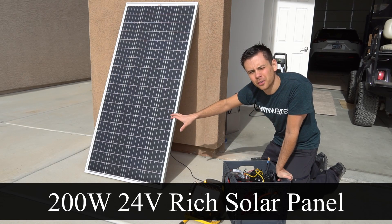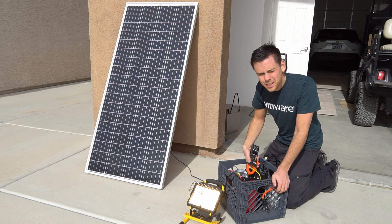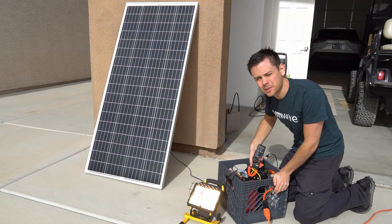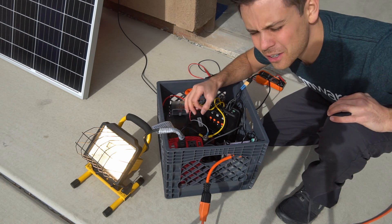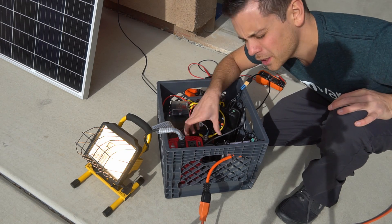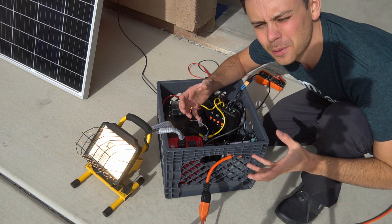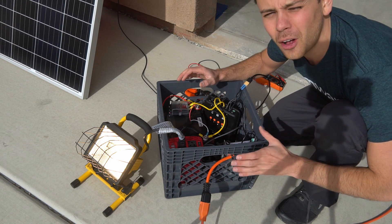We're connecting a 200-watt 24-volt solar panel to the system. We have 46 volts and we're charging at 6 amps. It is winter time and the sun is pretty low and cloudy, but we are charging. With both solar panel and AC input connected, we have 20 amps at the output of the solar charge controller — solar input, AC input, and AC output all at once. We can run this all day, no problem. Because we're using lithium iron phosphate, we can run this for the next decade or longer. The cooling fans are running, and it's great to have airflow with all components separated.